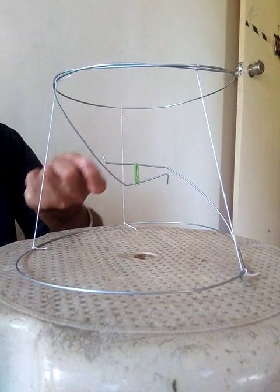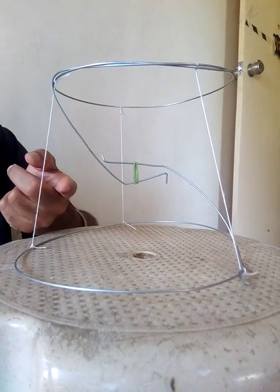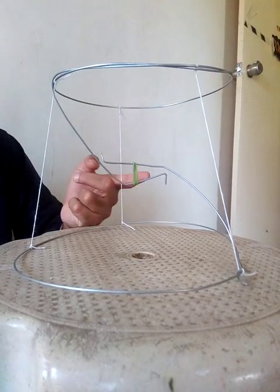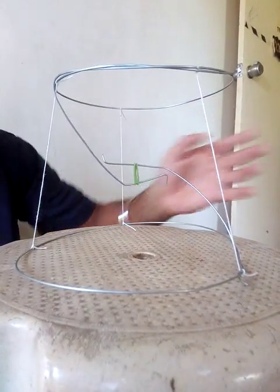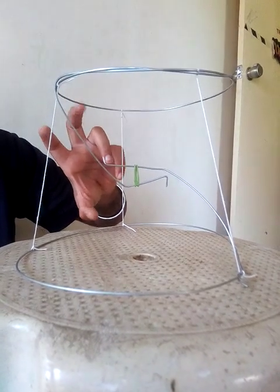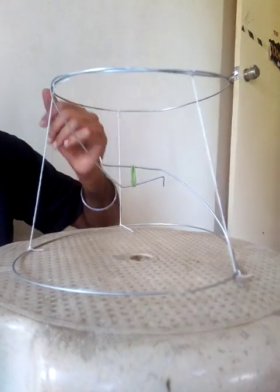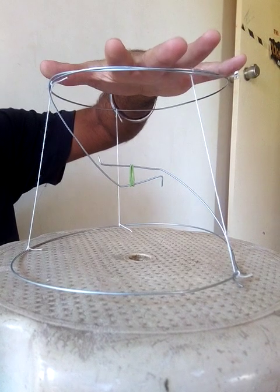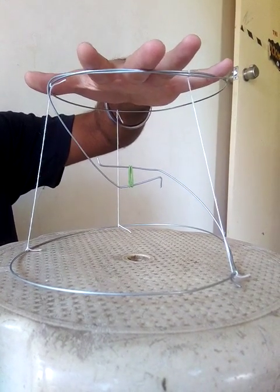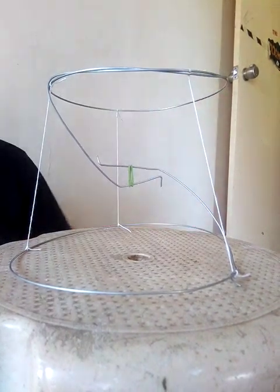Because of the rubber band's pull and all the tension, the top ring also exerts a tensile force on the three strings, and thereby the entire mechanism comes into equilibrium. It is in such equilibrium that it can take a little bit of load — I'm putting the weight of my hand on this and yet it remains stable.